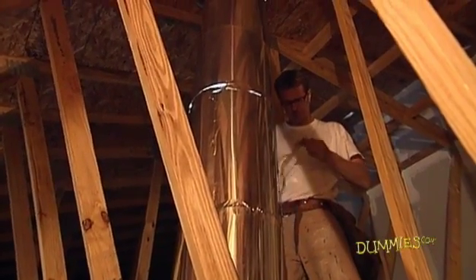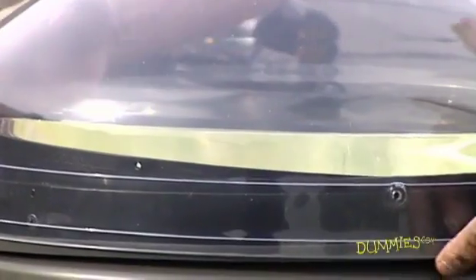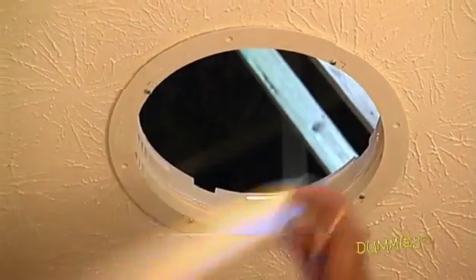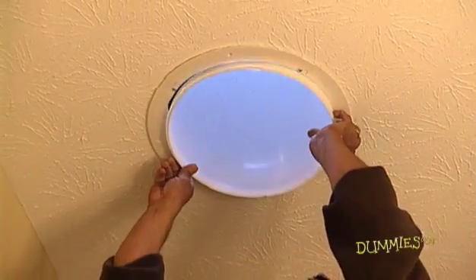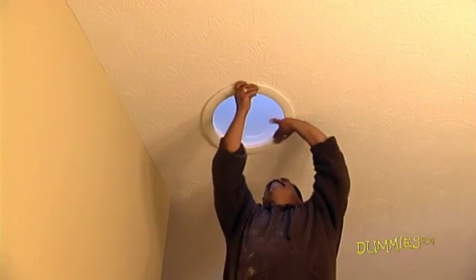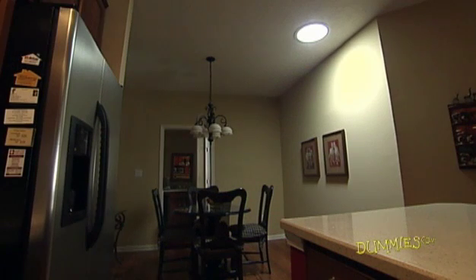Once the entire assembly is in place, use the tape and screws supplied to secure the fit. Back on the roof, install the dome at the very top of the skylight with the screws provided. Then go inside the house and secure the tunnel to the ceiling ring with the screws provided. Install the diffuser with the frosted side face down, make sure it is secure, and rotate it into locked position. Center the trim ring under the ceiling ring and snap the tabs into position, or align the tabs with the notches and rotate to secure the ring. Now enjoy all the free light that your tubular skylight provides.